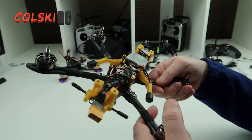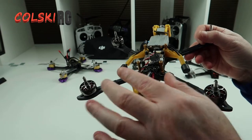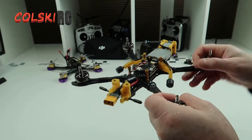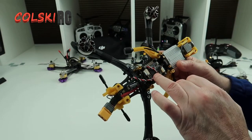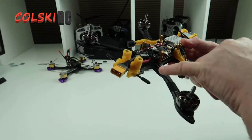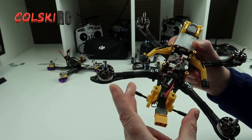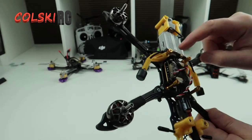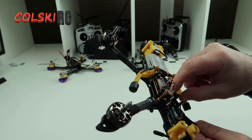As you can see we've got it in — very neat build. I brought the cable out the back here; this is the bit where your GPS unit would go. I've made an addition so this battery cable will come up where that was, so there's no battery in the way. These are the only three wires you need to solder, and they're for the receiver — which I've tucked under there, it's an XM Plus — and I've brought them out through these little tubes. I've got the stack connected to there, and that is the wire for your air unit.